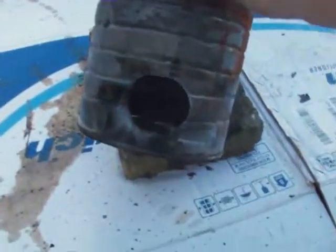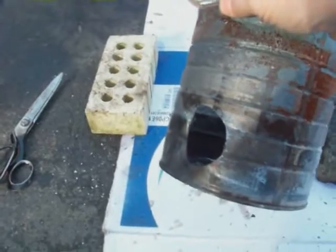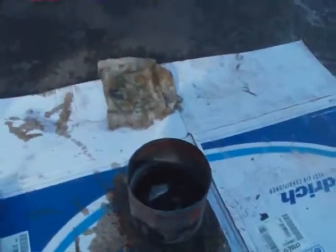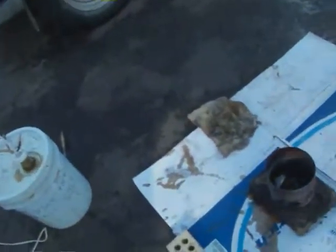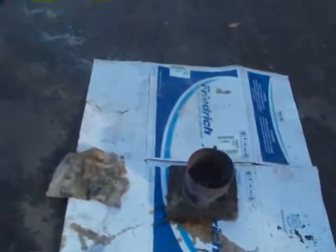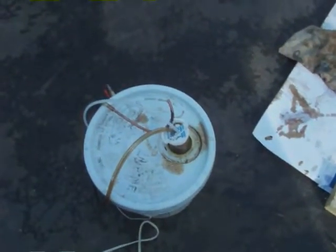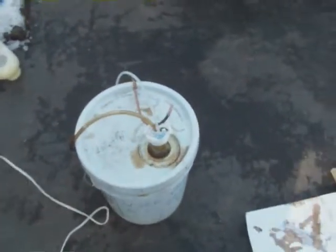Here is my oil burner. I ran it through a few test cycles. Basically it's a coffee can — this is just a test burner. Right here you have a hole for air, and here is a hole where you insert your fuel. There's no wick; it just drips down the bottom. There's usually a thin layer of oil on the inside. As the oil gets hot, it vaporizes and the vapors combust. This is simply used engine oil from whatever cars I can get my hands on.